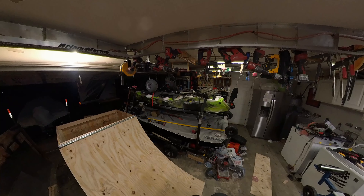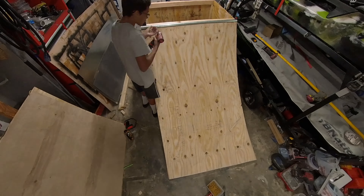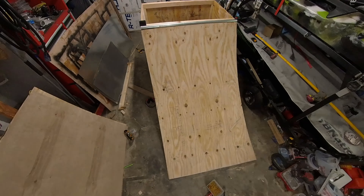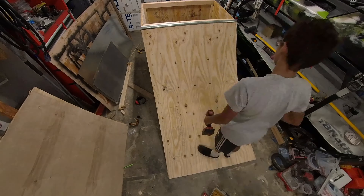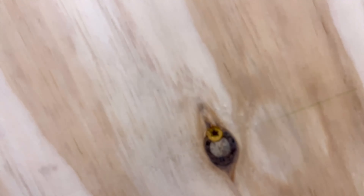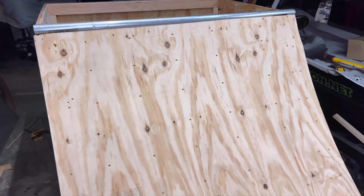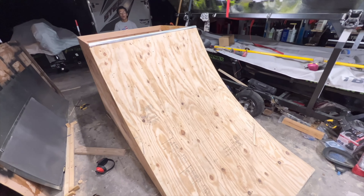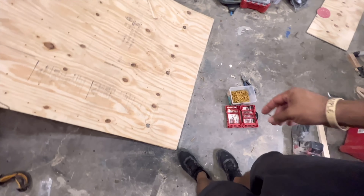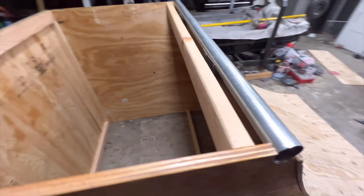The initial piece we cut first still fits, so we just tacked it down with a few screws and drew a line down where each stud is so we could insert screws along each line. My son came out and took it upon himself to put all the rest of the screws down in each slot. There are many studs and you need about eight screws across each stud to really crunch down that three-eighths plywood. Going from top to bottom, the screws just sink right in and it tapers in nicely.